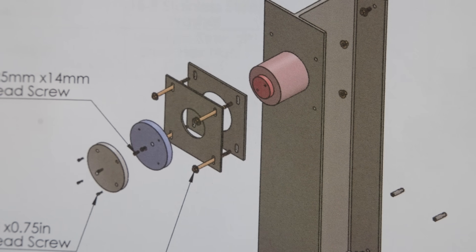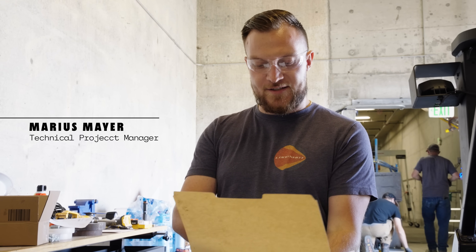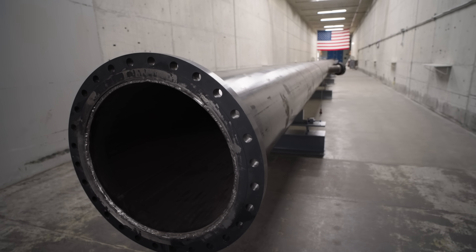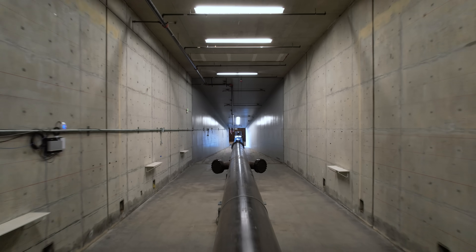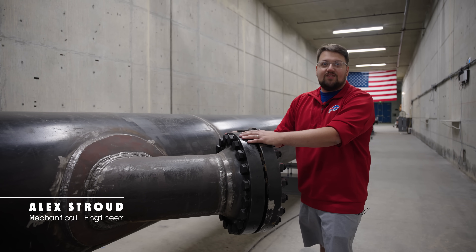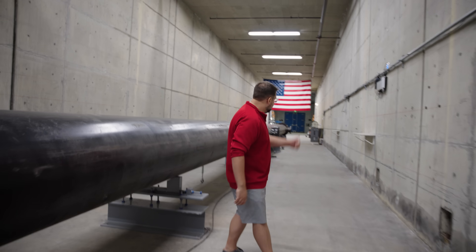The bracing and the actual putting together of the cannon — that was all new. Today we are mounting the gun brace and the booster braces, so next week we can test with the first set of boosters. The interior diameter of the barrel is 29 inches and we have six pressure vessels — they inject symmetrically from the sides, directly opposite from each other. We're trying out different angles to get the correlation for simulation. These are going to be fixed in place at a 45-degree angle, with braces mounted in the walls.